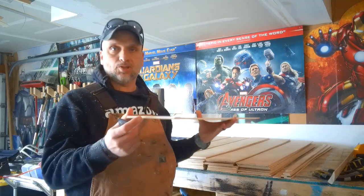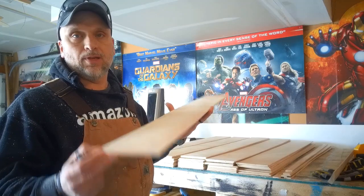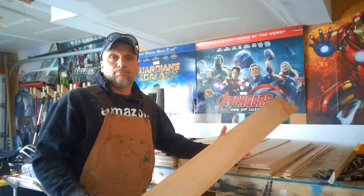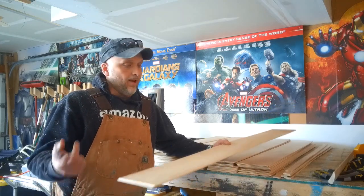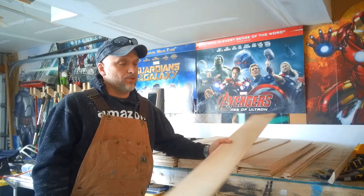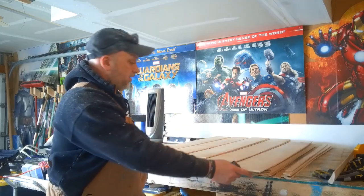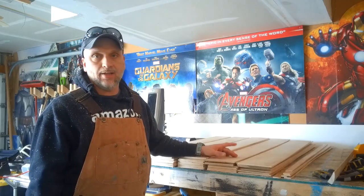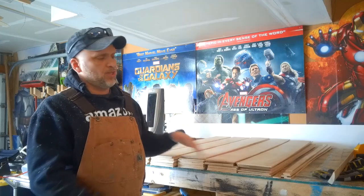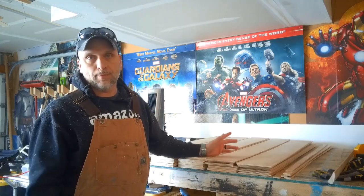So like I said, it's just 1/4 inch Luon. It goes for about $13 a sheet at Home Depot. Comes in 4x8 sheets. I had them cut it down into 4x4 squares just so it's easier to get on the table saw and get a cleaner cut, and ripped them down into the 5 3/4 to get the most out of it. So right here I got 48 strips, so it's going to come in between 90 to 100 square feet. It's going to be close. You have high baseboards in the house, so a lot of that's going to take up some of the space. But if I have to go get some more and rip it down, it's not that big of a deal.